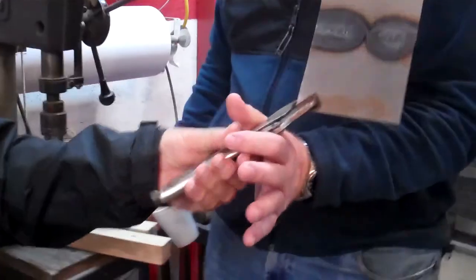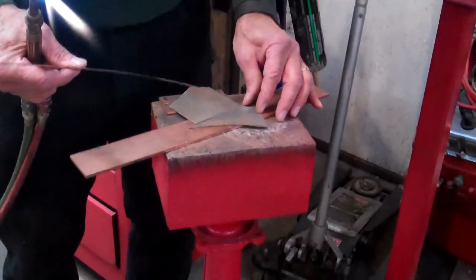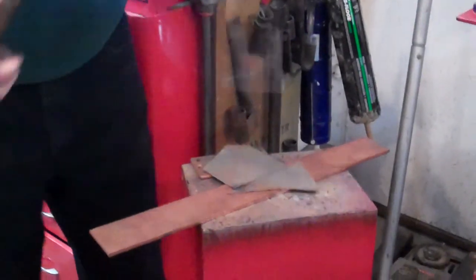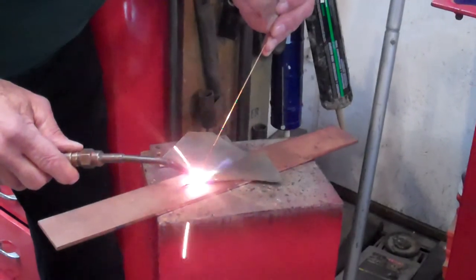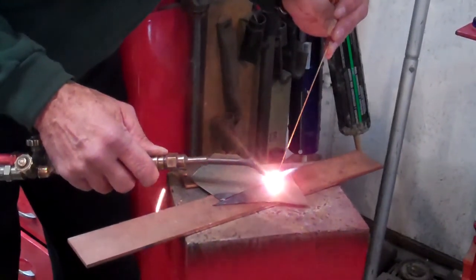I'll give her a flip over now. This is what we call a butt weld and a hammer weld. This is going to go on YouTube — Jack will add this by the end of the day and send it to Hillary Tom way back there. Welding with a gap — the gap should be about the size of your rod. It's not clamped in position; if you wanted it nice you would clamp it in place so it doesn't walk around. So to your point, tack it.